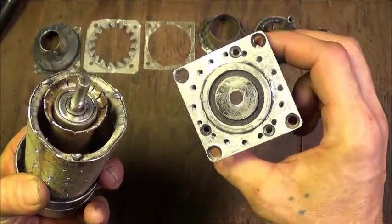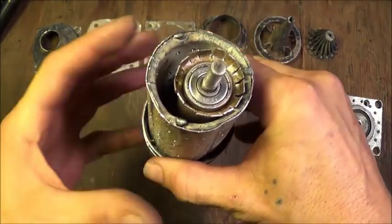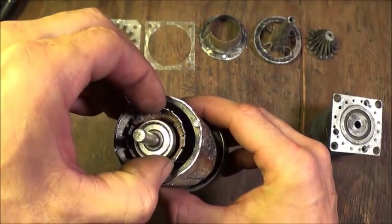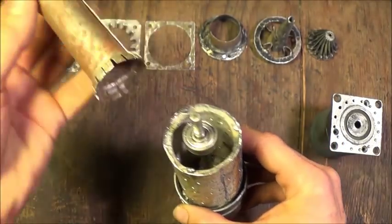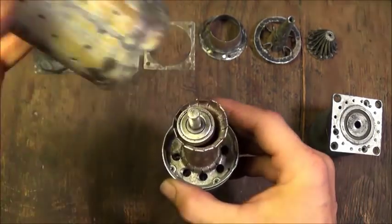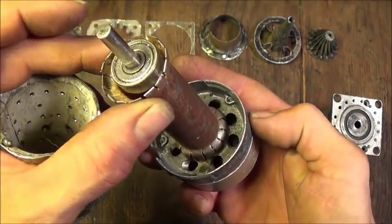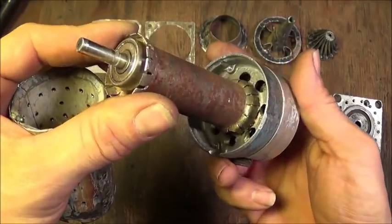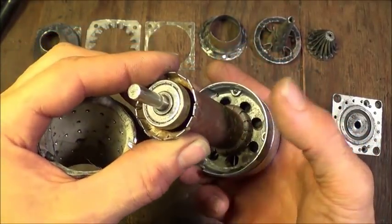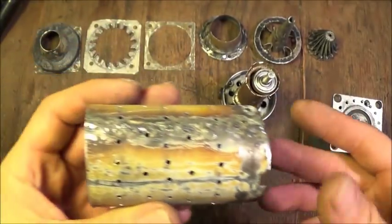You can see here we've just got our diffuser holes going into the case and the rest of the engine right here. What I've got over the center of this is a cooling sleeve to keep our bearings and our driveshaft cool. It's basically just a sleeve that sits over that, and at the end of the sleeve the end cup flares out and goes over the bearing cup, so it covers the bearings and keeps them cooler than they would be if the flame was able to directly hit our driveshaft and bearings.